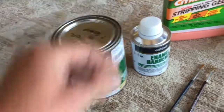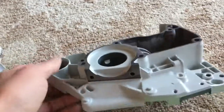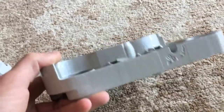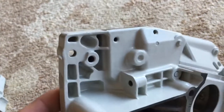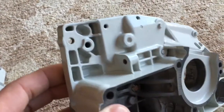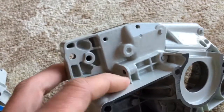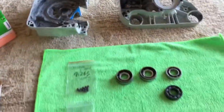The way I do it is I take a teaspoon, scoop out 16 scoops of paint, and toss in one scoop of the hardener, then mix it up. If you read the directions, you're supposed to let it sit for 30 minutes before painting. I just paint it by hand with little brushes, put it in the oven for 30 minutes at 250 degrees, then put it out in the sun to help cure it. You can see what a beautiful finish two coats produces — when it dries and goes in the oven, the paint shrinks and conforms very nicely.